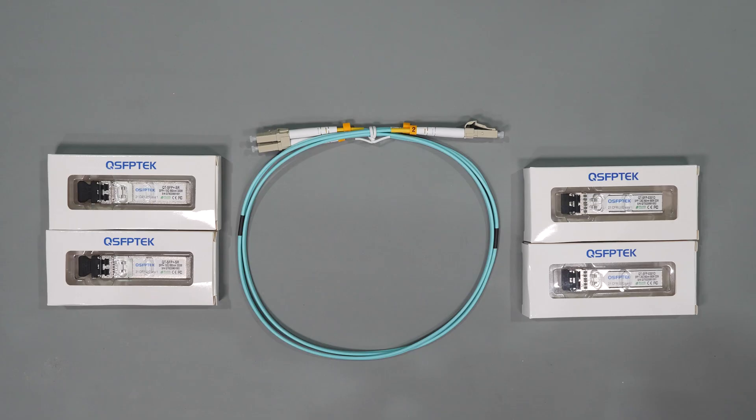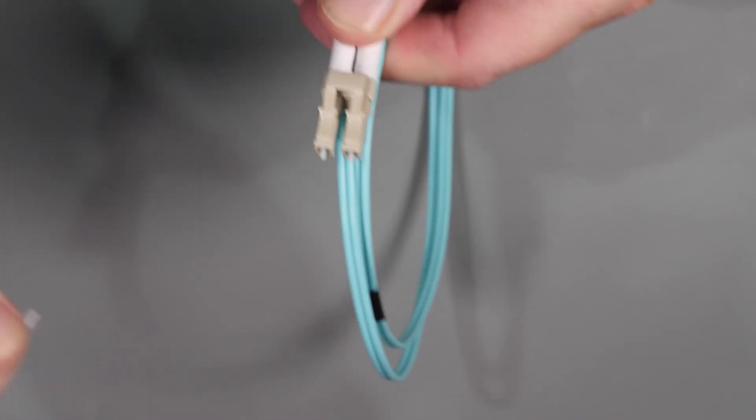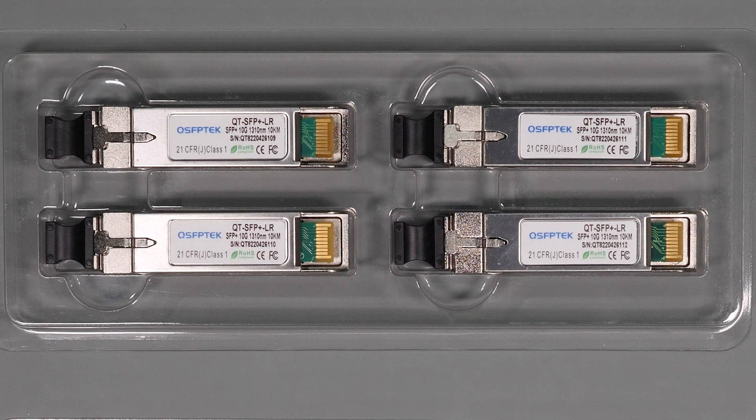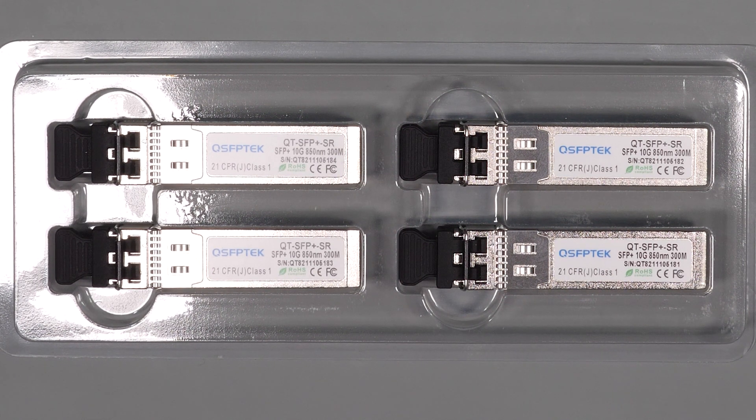This brings us now to the fiber transceivers. These offer a couple of advantages over the RJ45 versions, with the first being cost, as these can be around two or three times less expensive depending on the application. Though fiber cable itself costs more than CAT6A ethernet cable, there can still be an overall savings using fiber transceivers. Additionally, fiber transceivers are available in a variety of types such as long reach (LR), which can get distances up to 10 kilometers, or short reach (SR), which can get distances of 300 meters, making fiber a better choice for long-range projects such as running a connection between two buildings.